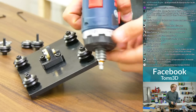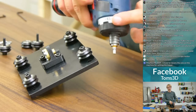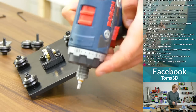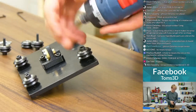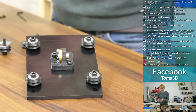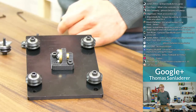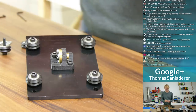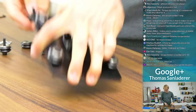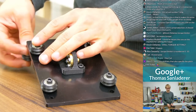So these numbers are roughly newton meters. Roughly. I've tried it out on the Bosch ones, and the Bosch ones are pretty close. The Bosch clutches. So you're saying the numbers on a clutch. Yeah, these tiny 10.8, or now they're called 12-volt cordless drills, match up fairly well to what a torque wrench is going to set it to, with 1 to 20, etc. newton meters. At least on the Bosch drills, on this series, roughly. It's good enough for that sort of thing.